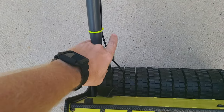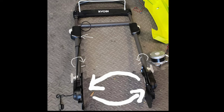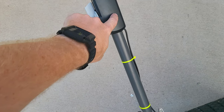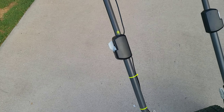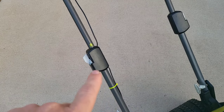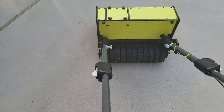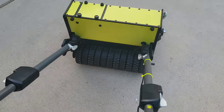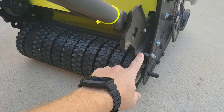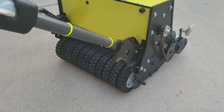this bracket. This whole unit was actually flipped 180 degrees on both sides. There's a safety switch in here, so as soon as you flip this pole, there's a hole in there where the safety switch pops out and completes the circuit going up. I actually had to take a Dremel and a couple drill bits just to make sure everything was opened up and the switches were functioning from here and running up to the handles. Once that was functioning, then I knew that I could continue on and finish the mower. The width of the mowers were a little different, so we tried to get them as close as possible. I did end up having to still put a spacer in between here to get this width right across to get it to mount to the frame on the Fiskars mower.